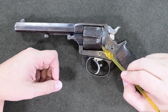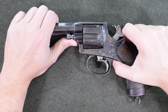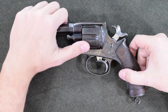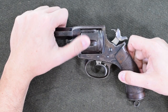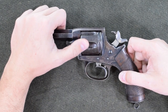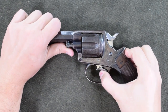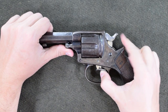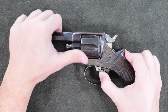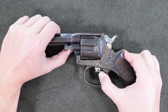This doesn't work until the trigger is pulled. So let's try the Colt/Smith & Wesson gun show method. I see a lot of guys that pick up these old Tranters or other old European revolvers, and they cock the hammer back, and then they go, 'Oh, there's so much slop!' But if I pull this trigger and hold it — keeping the trigger depressed and letting the hammer down — it's all gone. There's no movement in this gun whatsoever, and I've inspected it. This thing has perfect alignment on all six chambers. You would have been confused into thinking this gun was out of time, but really you just didn't understand the mechanism.